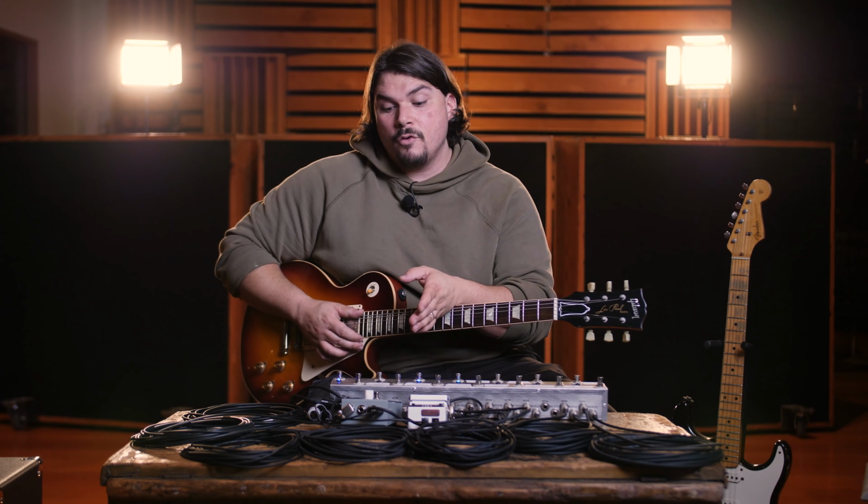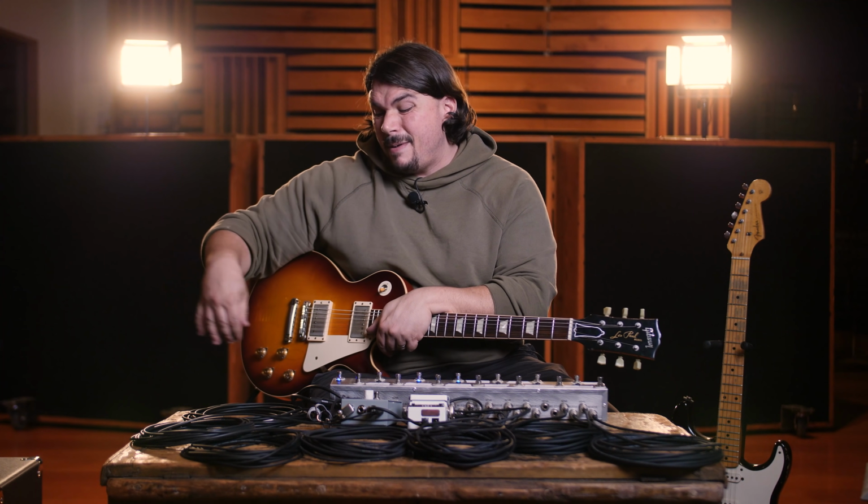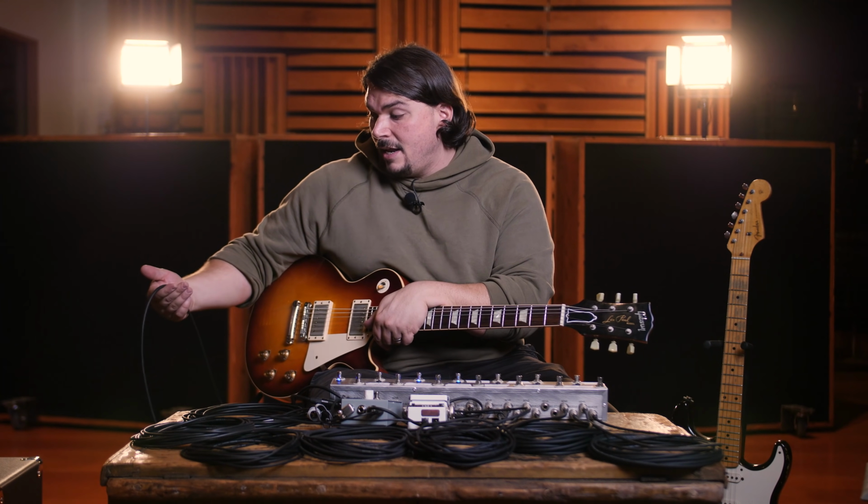of that high end, and you have to remember that even in the bypass sound, I'm still getting the cable going back to the amplifier, and when I involve the buffer, it's actually eliminating that cable capacitance. So really the only capacitance I'm seeing is what the guitar is plugging into when it goes into the loop master. So that's just some food for thought.